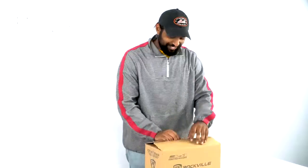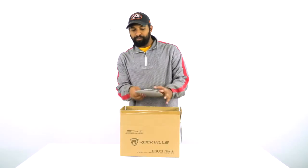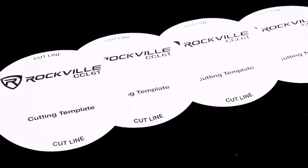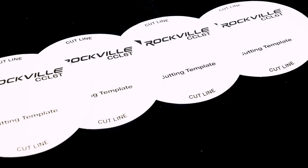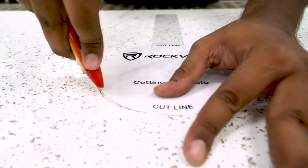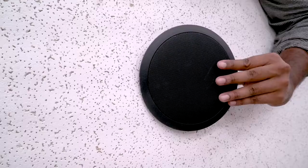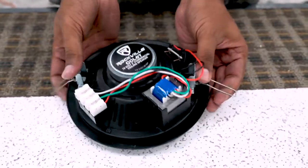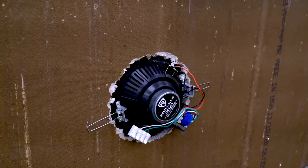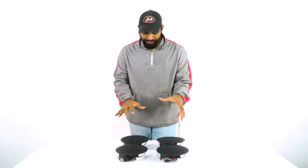I have the set of black six inch speakers here. Let's open this up and see what's inside. At the top we have four different cutout diagrams — it's really easy to install these into a ceiling or into a drop ceiling tile. You just use the cutting template, put it onto the tile or the ceiling, cut a hole right around the size of the template, then push the speaker in. Push up the retainers on either side, push it in, then let go of the retainers and it'll actually pull the speaker into place.